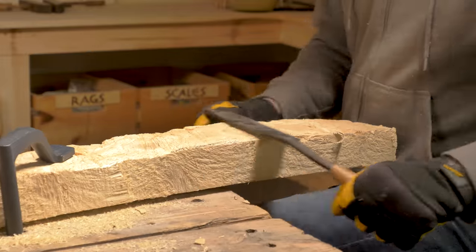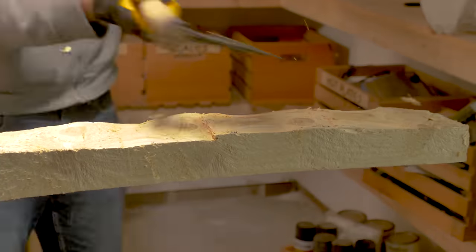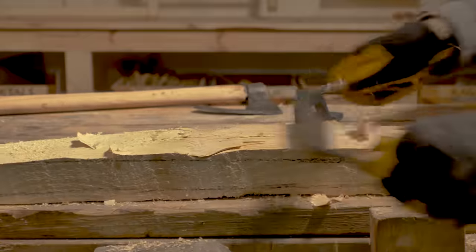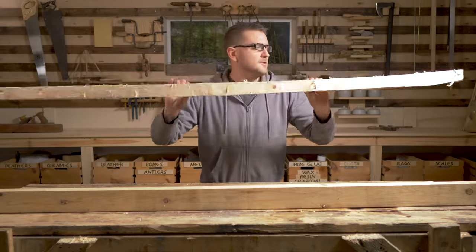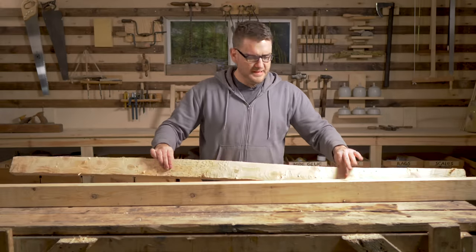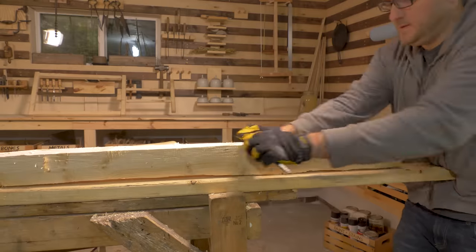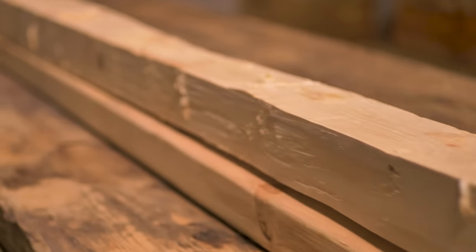I can do a little bit of handiwork with a draw knife and whittle out a straighter 2x4. After a fair amount of planing and draw knifing, it's looking a lot better and a lot closer to an actual 2x4 — took out some of the thicker areas to average out some of the curve. This is a much more promising 2x4. Comparing to a standard one, it's a little thick, a little uneven, still a bit rough, but passable — I think I've seen considerably worse boards than this for sale at Home Depot. For a first attempt, it's a pretty good win, though it's obviously a learned skill.